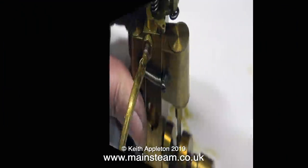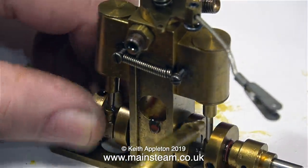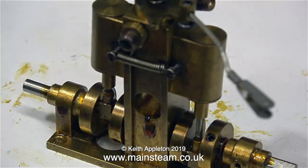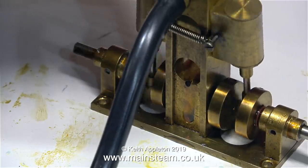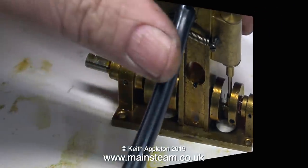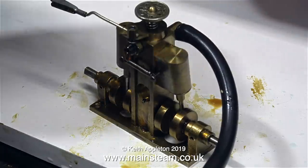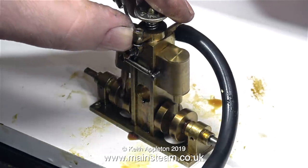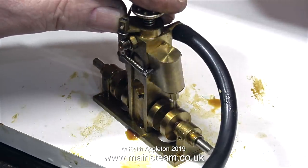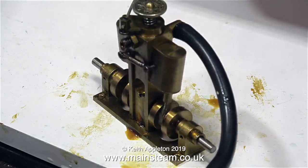This is the paddle boat variant of the Pintail, and you can see why if you look closely at this clip. As I'm oiling around the engine, you will see that the oil holes on the two outer bearings have the holes for the oil in the side — normally these holes are in the tops of the bearings. As expected, the engine runs very well. I'm fitting a piece of silicone rubber pipe to the exhaust port. With an oscillating cylinder engine there's no such thing as a fixed exhaust port, because you can go in or out of either of them and the engine will go forward or reverse respectively. That's what the reversing valve does on the top. I'll stop talking for a while and just leave the engine running so you can listen to it and watch it.